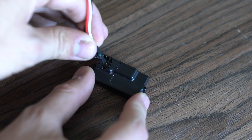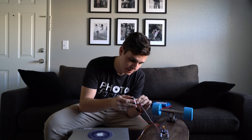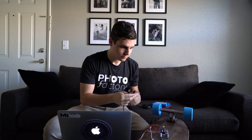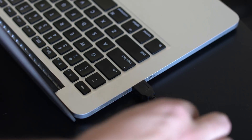Now connect your receiver to the built-in servo cable: white goes to the signal, red and black go to plus and minus, and plug that into channel one. Before everything gets going, plug in your USB cable — it comes with the VESC. If you're using your own USB cable, make sure it can transfer data. Thinner cables often only work for power and don't communicate with a computer, so if it's not connecting, that's likely why.